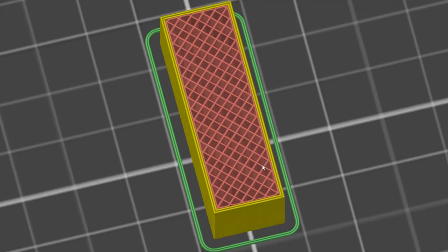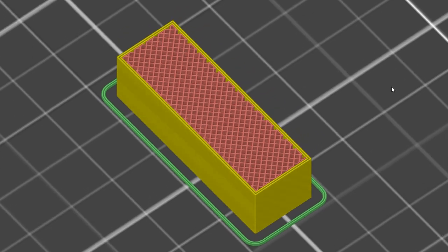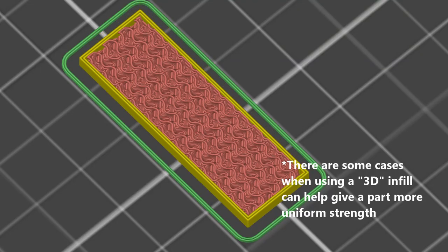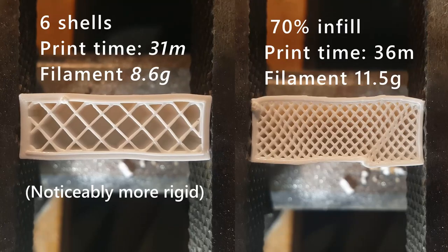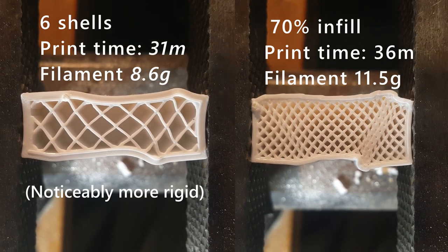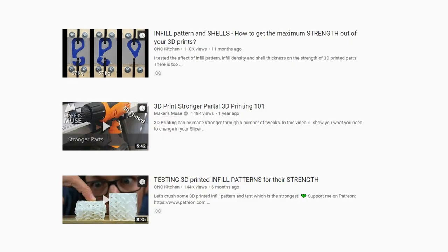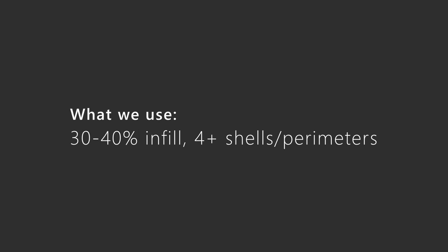While making this value bigger will result in stronger parts, anything past 40 or 50 doesn't change the strength much relative to the increase in print time and material used. Infill type does have a small change on the part, but is really not worth changing due to print time increases. There are some great YouTube videos we will link in the description that have more scientific support for this. The general rule of thumb we use is, for a structural part, use 30 or 40% infill, start the shells at 4, and increase if more strength is needed.